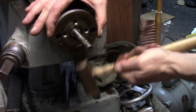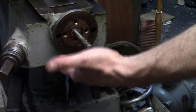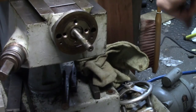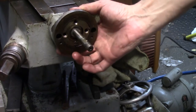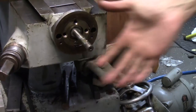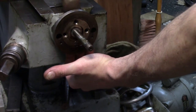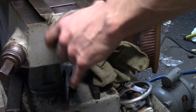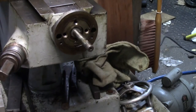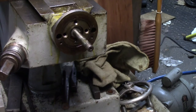According to the diagram, there are a couple of little locating things. Yeah, there's a seam coming up, so it's definitely not all one piece. The last thing we want to do is damage this housing, since getting a replacement is very difficult. Replacement parts for these mills are either completely unobtainable, or if you find them used they're going to be expensive. Clausing does stock a surprising number of parts still, but get your wallet ready — best guess is if Clausing had this little housing, they're going to want $400 for it. So we want to be careful. I might switch to a softer hammer, maybe a lead hammer. I'm pulling on the bottom and tapping on the top. I'm going to grab a little machinist wedge and squirt some PB Blaster in there to free that up.